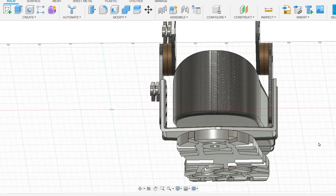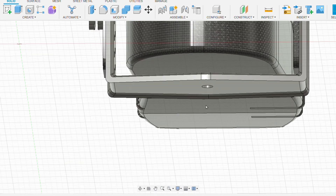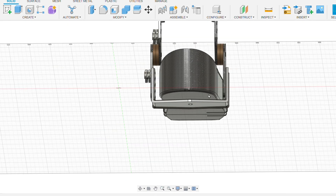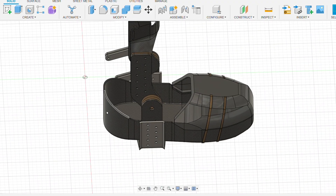The lower carbon fiber bracket attaches to the main ankle piece, which if we rotate around to the back you can see goes underneath the main piece of the boot. With the tread removed, I'll have a pivot point under the bottom — I'll drill a hole into the main piece of the shoe or boot, which will allow the main piece of frame to pivot on its own axis around the bottom of the ankle. Rotating on again, we can see these main boot parts — almost like an armored clog.